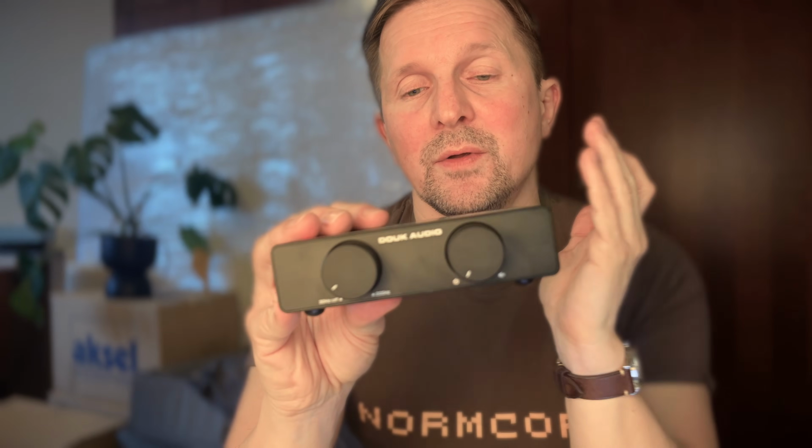And it means that you can hook up a subwoofer to it and cut out lower frequencies that are sent to your main speakers. What it means is that your main speakers are now less strained by those lowest frequencies that are reproduced by your subwoofer, and can focus on the rest of the bandwidth, and they can reproduce the rest of the bandwidth with less strain, more easily, and thus more clearly. And I haven't seen such a high-pass filter that has regulated frequency in those small units so far.